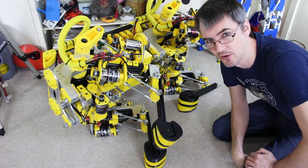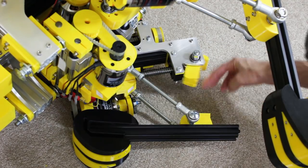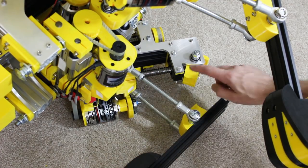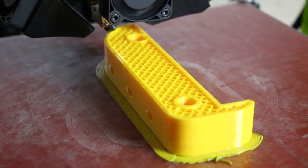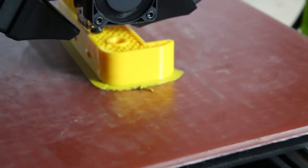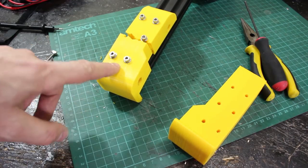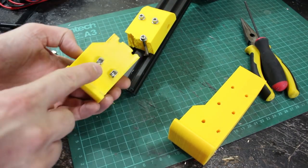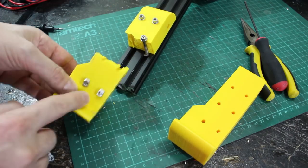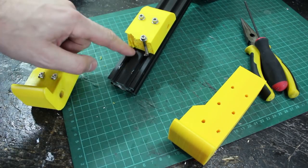There was a snapping sound in one of those clips and on further testing the whole thing fell over and actually a piece broke. It's one of my 3D printed knee joints — look at that, it's gone clean through. So I'm going to reprint that; the others look alright. I printed the replacement with the Moarstruder so it's nice and tough. But on closer inspection I noticed that those T-nuts didn't actually turn round properly to grip the slot — they should be the other way round. That's why this one just snapped and pulled off, and I couldn't see them because I couldn't look in the end. So we'll just have to be careful that all the nuts are done up properly.